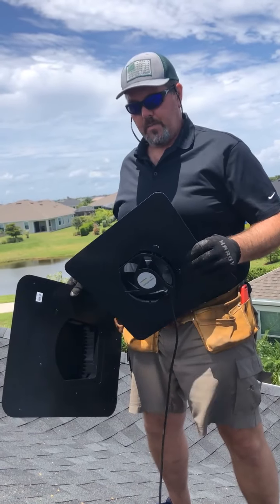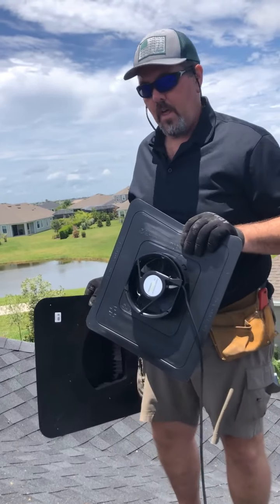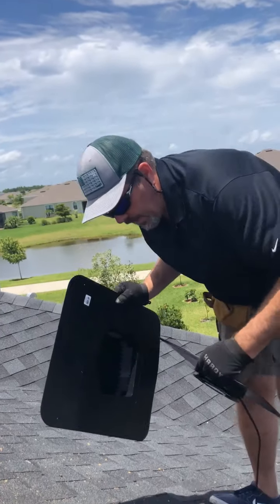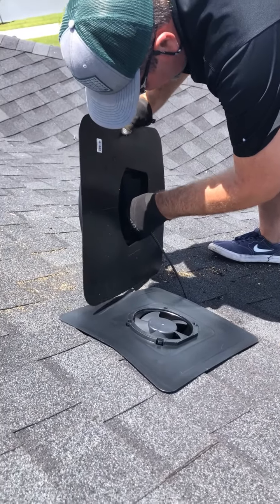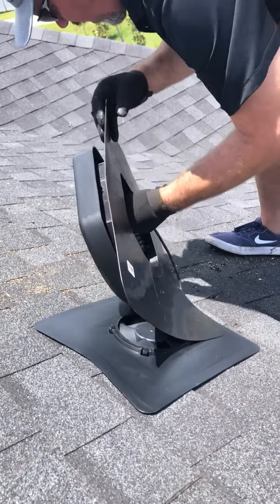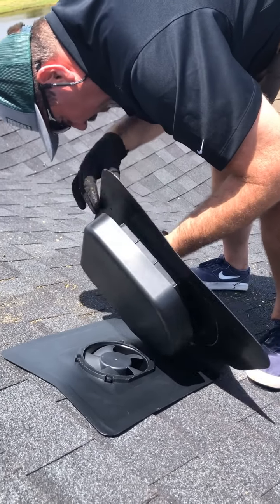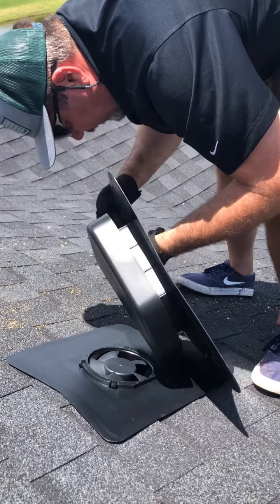The 19 watt modular solar is a separate fan unit with a patented design, so it's retrofittable. With the Snow Ventco, because it has the extra filtration membrane inside, we need to go ahead and just make a small slit. Then we'll feed this coupling through for the fan unit, and once that's through, we'll be able to connect it to the solar panel.